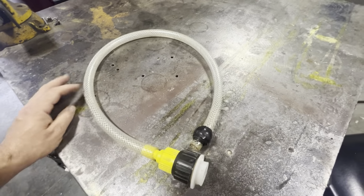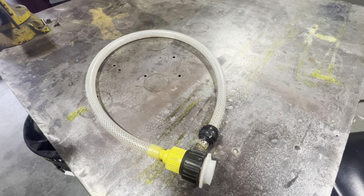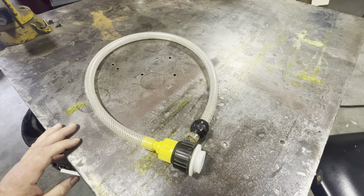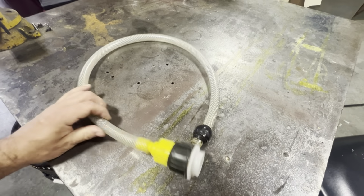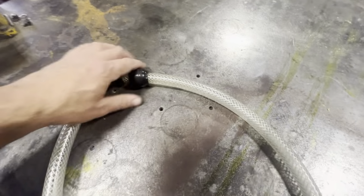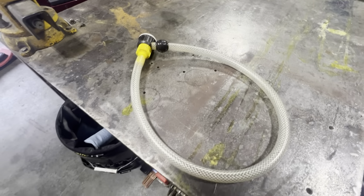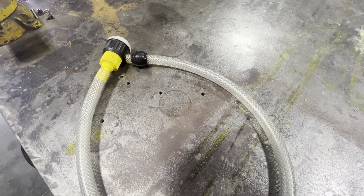All right, and then this is what I got for my ballast tanks. I use 1 gallon of RV antifreeze per ballast tank, and basically, I use the installed pumps to create a vacuum on the tank and then suck it in with this little adapter that I got from the auto parts store. I took some electrical tape, made a big old ball on the end of it that helps seal where I put it in at the little through hole connector.